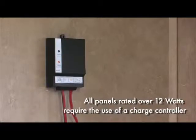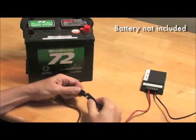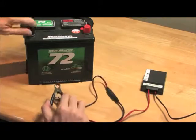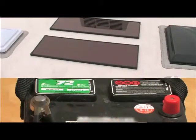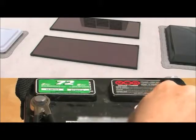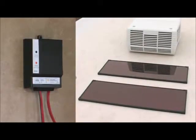Use the free power of the sun to power your life. To connect a solar panel to an 8-amp charge controller, first connect the battery clamps to the charge controller with the quick-connect wiring. Then connect the battery clamps to the battery, negative to negative and positive to positive. Then connect the solar panel to the charge controller. The system should now be fully operational.